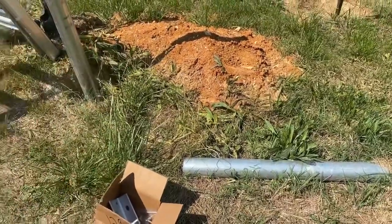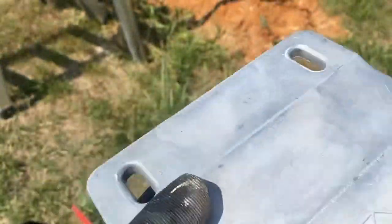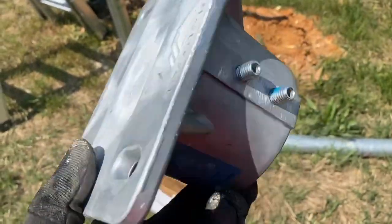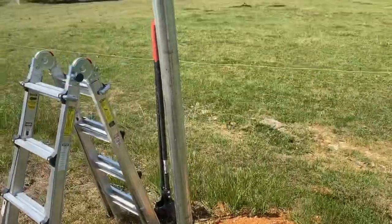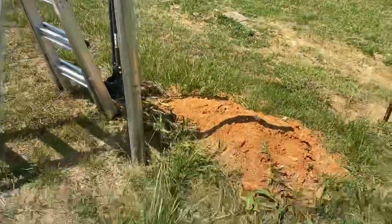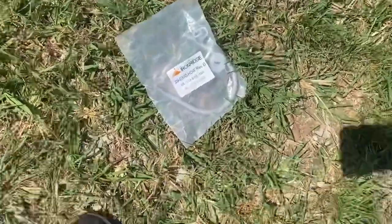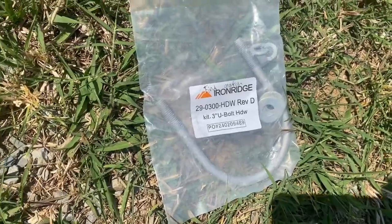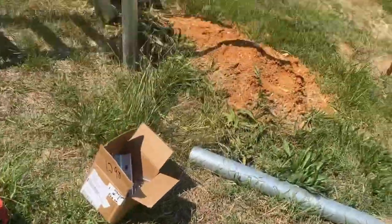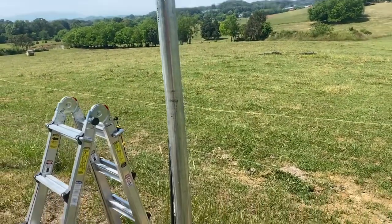This top cap will go across it. Right here you can see the IronRidge cap — they make these in two-inch and three-inch, but I definitely encourage if you're going to do a top-of-pole mount single with three panels, go with the three-inch one. I'm going to drill through and put a long bolt through that, and these are held on with three-inch clamps. The IronRidge part number is 29-0300-HDW RevD3 — that's a three-inch U-bolt kit. All these parts can be acquired through Hurricane Wind Power as well.